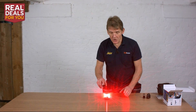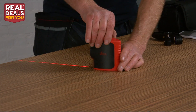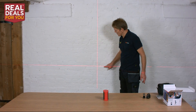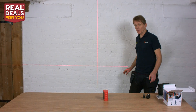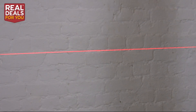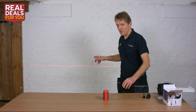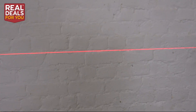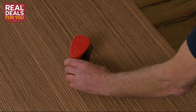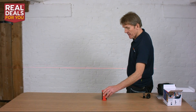Let's fire that onto the wall. The on/off switch will automatically fire up the first sequence, which is the vertical line and the horizontal line. If I press the on/off switch once more, you can see that the vertical line disappears and we end up with just a horizontal line. That horizontal line can be used to set out — if we were tiling around the room for example, we could set out around the room and just turn the laser as needed to keep that line going.